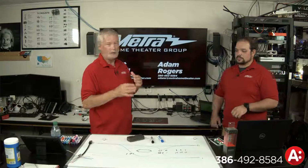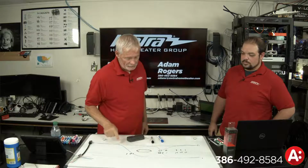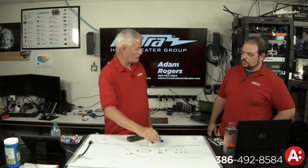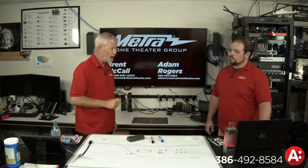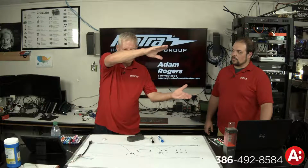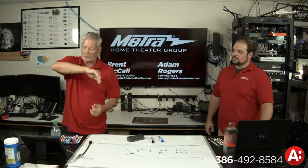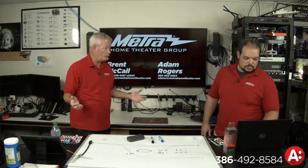Now, this is important because as the cable gets longer, this is a voltage swing. This is voltage driven. This is not current. And anybody that's done DC lighting or any kind of DC signal knows that as you get further down the line, that voltage starts to drop and the transition time gets closer and closer to non-change.